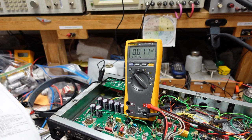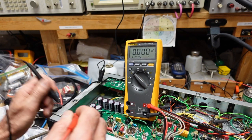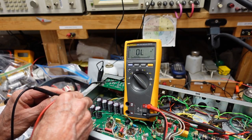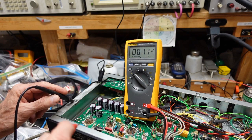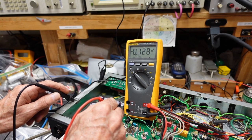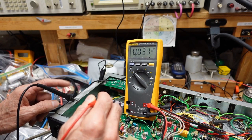Anyway, we're going to start looking for voltages on these tubes. Now we know the first tube is good, and I should have around 210 volts at the plate of V1. First plate is pin 1. They're tied together, so you've seen one, you've seen them both. We have 212 volts here. And if we go to V2, pin 1, that's going to be here. We have, holy crap, negative 0.7 volts DC. So we have a problem with this tube not getting power.